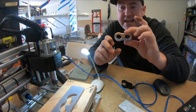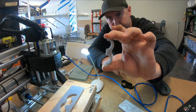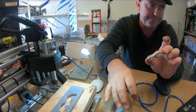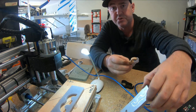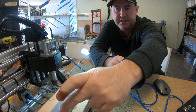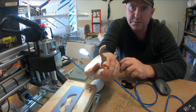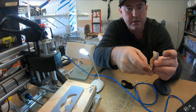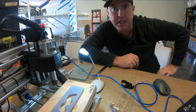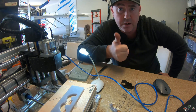So this micro CNC can actually do some stuff for you — it can cut timber, can cut tooling board really nicely, won't do aluminium but I didn't expect it to. I even went down to 0.1mm cuts on the aluminium and it just didn't like it. The tooling board and timber I was cutting at half a millimetre step-downs and it comes up nice. Link to all this stuff in the description below — I'll put some timestamps in so you can skip to the bits you like, and we'll catch you on the next one.